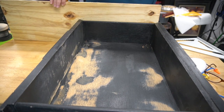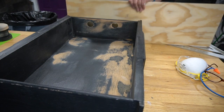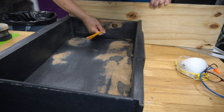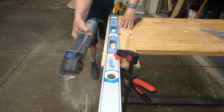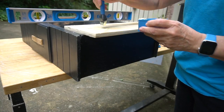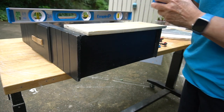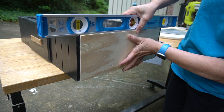The sides of the drawer needed to be flushed with the front edges. I found a wood scrap that was the thickness I needed and cut the two pieces to size. Since I was working by myself and I'm not comfortable with a table saw, I cut the piece with a Dremel Saw Max — it did the trick. To attach the new side supports, I covered the surface with glue, put the piece in place, made sure it was level, clamped it, and then added a few brad nails.